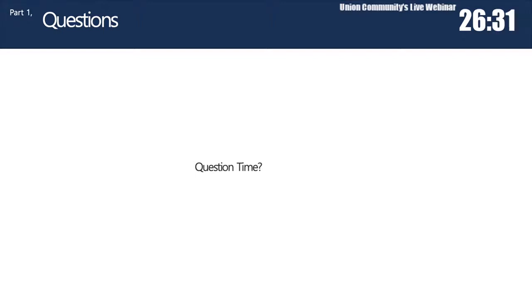Let me see some other questions. We have one question: what is AE? One of the options that I didn't discuss there. AE is an option in the facial setting, auto balance, auto lighting. This is based on our camera capturing in a 50-60 hertz ratio, and your fluorescent lights may be on the same frequency, which may cause some interruptions or interference with the video portion of our facial capturing. So in that case, you have the option to change the AE. If you're getting some interference where it's not very clear on the capturing of the facial, then that means the fluorescent lights in the air are probably interfering with the same frequency that we're using for the camera capture. So you can use that for checking it.